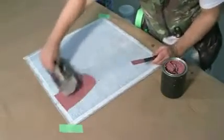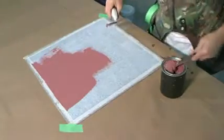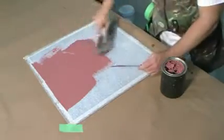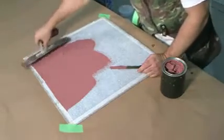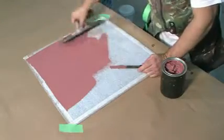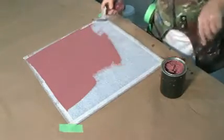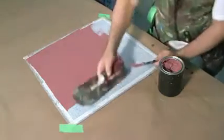Our aggregate is an acrylic plaster with a medium-sized silica particle throughout. This product is for both interior and exterior. Here we have tinted 3 colors of aggregate, and we begin with full coverage of the darkest color on the entire surface. Keep a light stroke during this coat in order to dispense an even layer with little or no scratching.